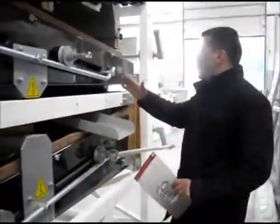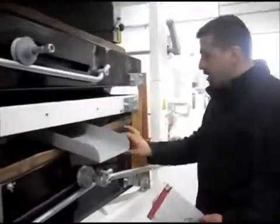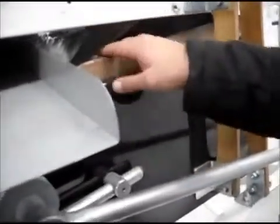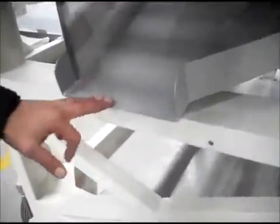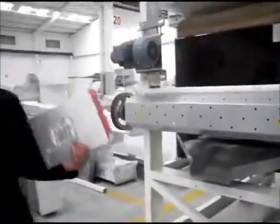Now, your prime seed still carries on to the final deck onto the screen, walking on a 3mm round perforated screen, and all the waste will be discharged from here again to a chute into a sack. And your prime seed will be discharged from here into a sack or into the next elevator hopper. Now, this is the work principle.